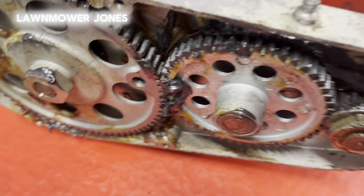So once it's serviced and greased, you'd obviously check the condition of your rollers — they're in good order, they turn okay. If they've got stiff and the axle's seized up, it's quite easy to take the brackets off and free the rollers. It's a steel shaft, you just give it a really good clean and refit your rollers. Assuming they're okay — or if they're woodworm or split — you'd obviously be looking at replacing them, and you're not likely to get new ones so you'd get somebody to turn you up a nice set.